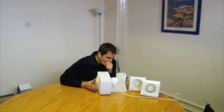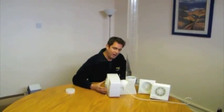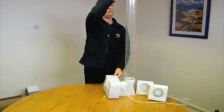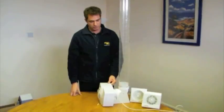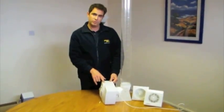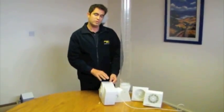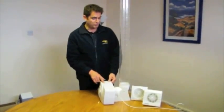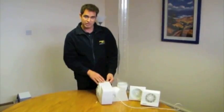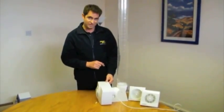If I just apply a little bit of moisture to the sensor by breathing on it, have a look at how effective it is at moving air from the bathroom. As you can see, it's an effective fan. But as I said before, it's tracking moisture all the time. So as the moisture levels in the bathroom fall, you will see that the counter will gradually return to its original position — making this fan not only effective at moving moist air from the bathroom, but also meaning that it requires far less energy to do so. The fan will also last the lifetime of the building, rather than just having a 5-year or 2-year warranty as with the cheap entry level fan. So there you have it — that's what we call effective extract.